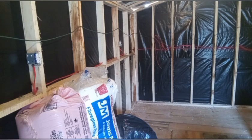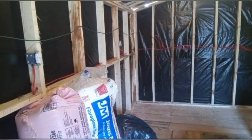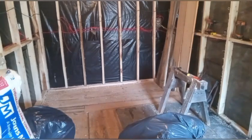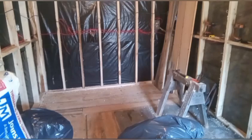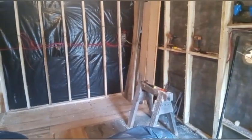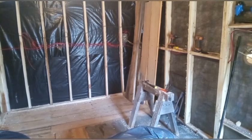But I had to get all that done before I insulated the shop. This green wire running right here is running to an outlet, and it was running the lights for about a week. The lighting circuit is completely separate. It's brought in from a separate feed off of the power source. It's on the opposite 120 phase from the rest of it. And just behind all that wood is an outlet off that, and its sole purpose is to run the Chinese diesel heater I'm using. Again, to keep it off the heavy draw of the tools.